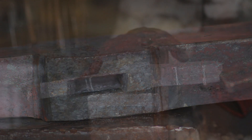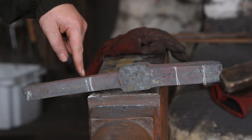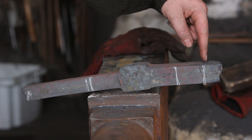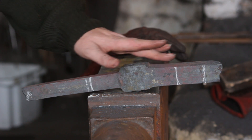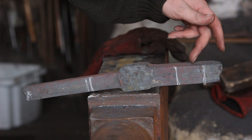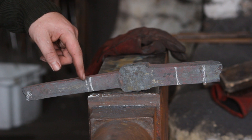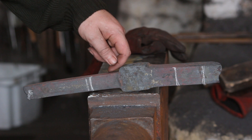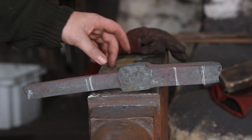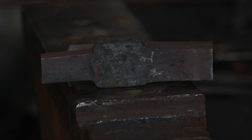At this stage I will cut down the billet. I have marked on the outside the furthest dimensions that it will be when it's finished, and the inside marks are where I'm going to cut it, purely because I'm going to be drawing out this material. On the left hand side it's pretty much the finished dimension but I'm going to be facing it, so I have cut it 10mm shorter. On the axe side it is 30 to 40mm shorter than it needs to be.